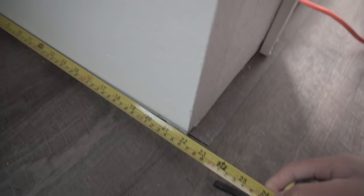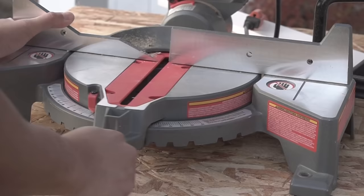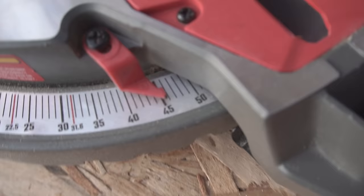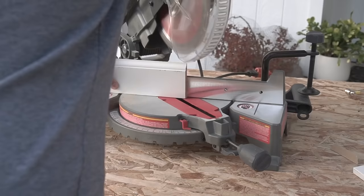As you can see, there is my laser mark and I account for the cut and the thickness of the blade. Now take your second measurement to the very end of that wall, then scoop it over to the 45.5 degree angle — right between 45 and 46 — and make that cut nice and slow.